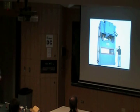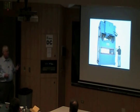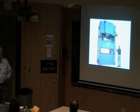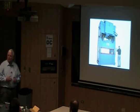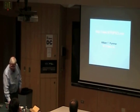but the information's available. Now, this I think is a 2,000-ton press you could buy off the shelf from a company called Beckwood in St. Louis. They make other sizes to order. And I think this would be capable of providing the pressure we need out to a diameter pretty close to a foot if you really were crazy enough to go that big. As the recommended pressures run from 25,000 to 60,000 pounds per square inch. And 2,000 tons will get you a lot of pressure, a lot of square inches. Okay? So that's where we are.